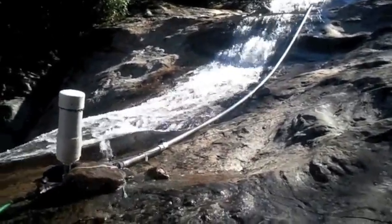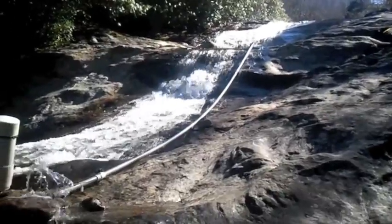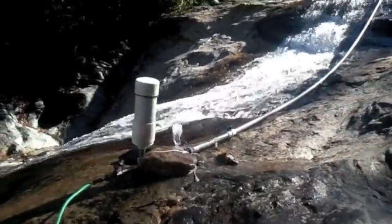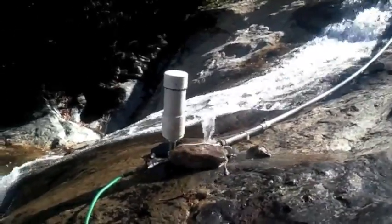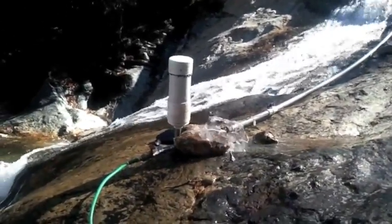What's going on at the top of the hill: there's a two-inch mainline in a plunge pool up there picking up water, dropping a good 8 feet, high velocity, slamming into the first part of the ram pump, which is a flapper valve. You can see the flapper valve cycling.